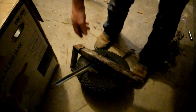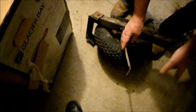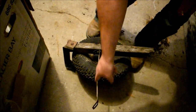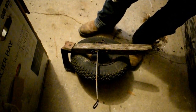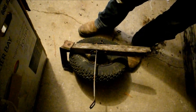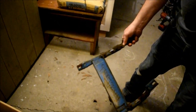But the problem comes in where this bracket brace, of course, when it was dilapidated and pulled apart, it was bent. Oh, I see. So we can straighten that out pretty easy and paint these brackets. Sand them down real quick, wire wheel them down to the metal, paint them with an implement paint with a hardener in them, and we can come up with a color scheme. This bottom bracket brace piece is not in bad shape.